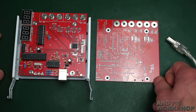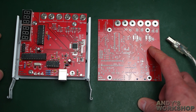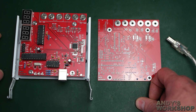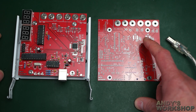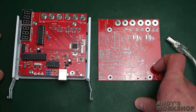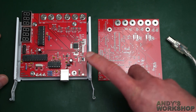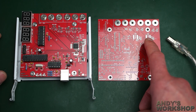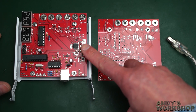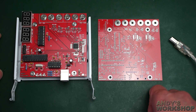This does overall limit accuracy and you probably wouldn't want to use MAX31865s in a reference design. You could probably rely on these to about plus or minus half a degree C. On the positive side, they are super easy to work with. It's SPI across to the MCU, and once running you basically loop turning the excitation current on, waiting for it to stabilise, receiving the ADC value, then switching the excitation off. Once you've read the output from the 15-bit ADC, it's a simple calculation on the MCU to convert it to an actual temperature. By contrast, the Linear Tech actually outputs a real temperature directly, which alludes to a floating point processor somewhere inside — which may explain the high cost.